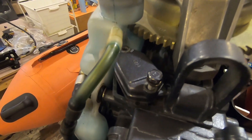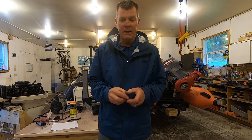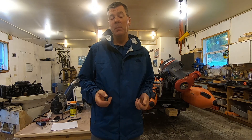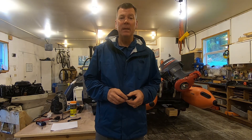That's it for thermostats on outboard jets. There's always a little bit of debate about thermostats in outboard motors — is it okay to run an outboard motor without a thermostat? Well, if your thermostat goes on you and your motor is overheating, you can definitely run it without one — it just allows more water flow and might take a little bit longer to warm up.